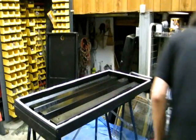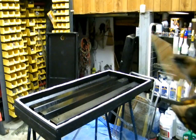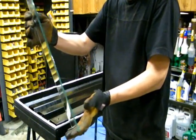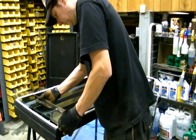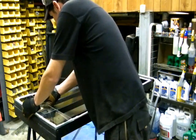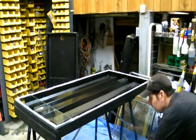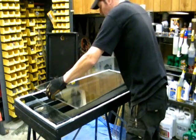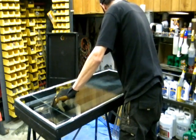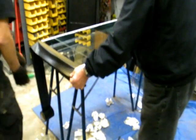I'm going to place the glass on top — a small piece goes on the end first. Always make sure you clean it very thoroughly on both sides because it's your last chance to clean the inside before you seal it forever. Just put the piece of glass on there and try not to move it around too much, because you don't want to squirt caulk into the painted surface. Push it down to the end and slowly squish it into place. This vinyl tape goes on around the perimeter.